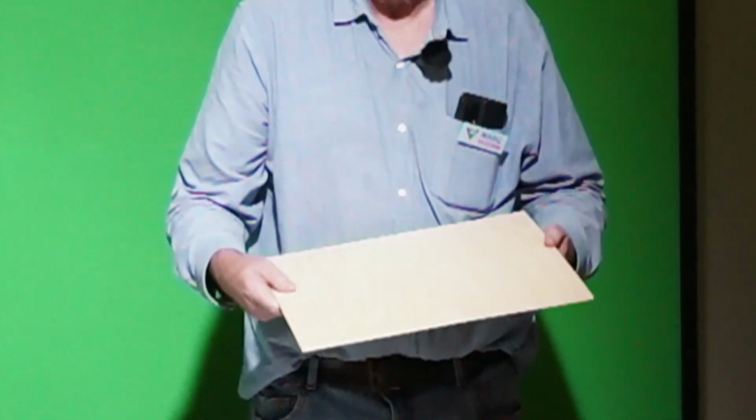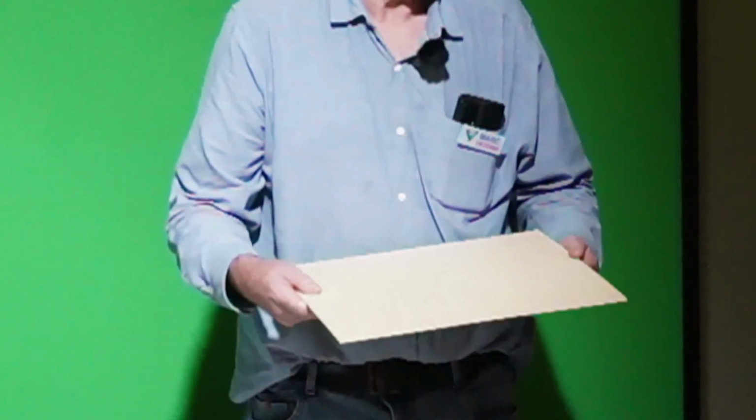But you can cut, it doesn't matter what it is, it can be MDF, any timber. But the issue is that every timber cuts differently. So you'll need a material test card for each different type of timber, because MDF probably needs more power or slower speed to get through it. So you can in theory use anything, I mean leather, paper, anything, but they will all require different power and speed to get through it.